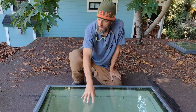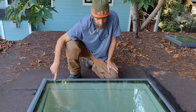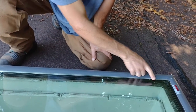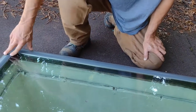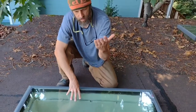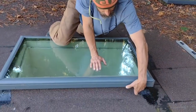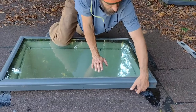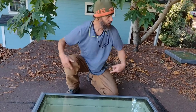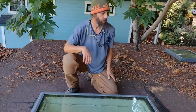We just replaced the skylight on this one. There is a little gasket in there — this box is a little smaller than it should be, and that gasket needs to seal around the two-by-six that's in there. I'm pretty confident the water is not coming in through the skylight itself; that would really be hard wind-driven rain, and the rubber gasket is sealing just fine. We've wrapped all the corners, and this spot was a little suspect. I hope that's helpful — leave comments below and let us know how you would do it. Thanks for watching.